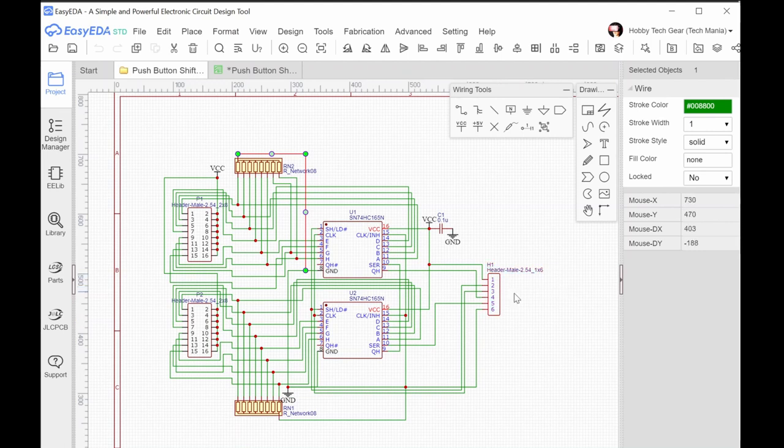The boards daisy-chain to whatever number you need, limited by the MMJoy firmware. This connects to the Arduino Leonardo or Micro on certain pins. Unfortunately, even if I show you my circuit diagrams, you do need to understand how shift registers work and how to lay out the push buttons and analog potentiometers — this requires a foundation in electronics and soldering.